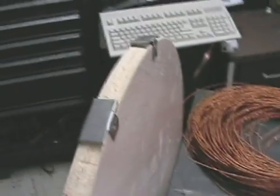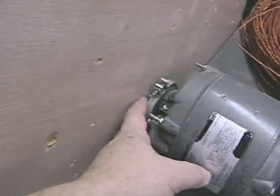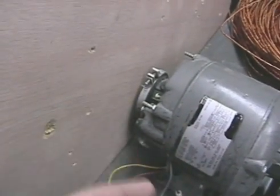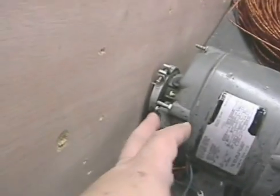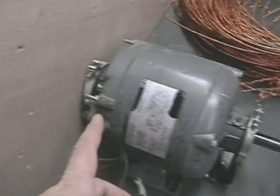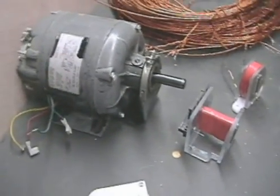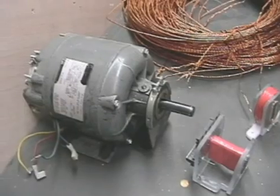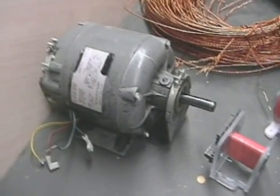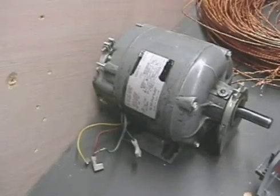The magnets are sitting sideways on the wheel, so as it fires it's going to fire closer to the coil. They're going to be bolted on the edge of the wheel, with a collar to keep the wheel on the shaft — most likely an old pulley. On the back of this motor there's a shaft I can use to create an optical trigger or a smaller magnetic trigger, allowing me to adjust timing if I decide to go from magneto-type coils to an optically triggered coil.